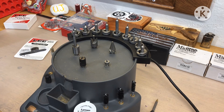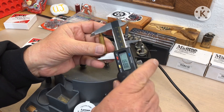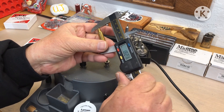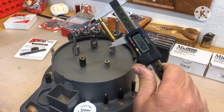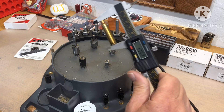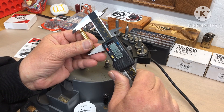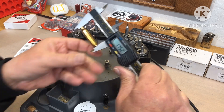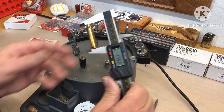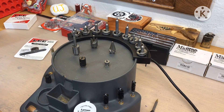This one is prepped — easy peasy, lemon squeezy. Measuring 1.752, and that's what I'm getting. It's trimming beautifully and it takes very little effort. These didn't stretch at all being once fired — whoever's gun that was wasn't running too hot because it was PMC. On NATO brass it'll probably be different.